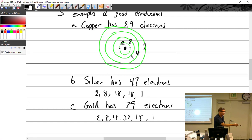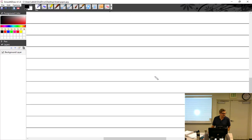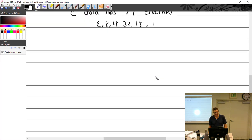Corrosion causes heat. In homes it became a disaster because it would corrode next to the component, the switch or the outlet, and that corrosion caused heat, which then caused a fire. So aluminum wiring is kind of a fire hazard. Oh yeah, dissimilar metal corrosion. Absolutely. In homes, they want you to use a special grease and a special fitting to go to a copper wire that goes to the components. Crazy. All right, so that's our conductors.